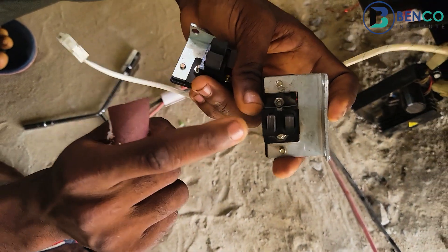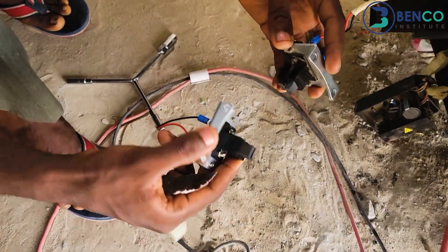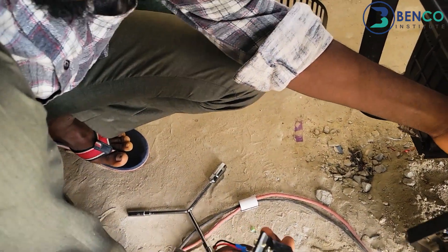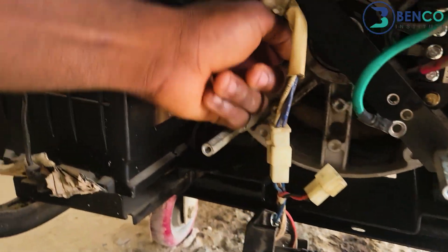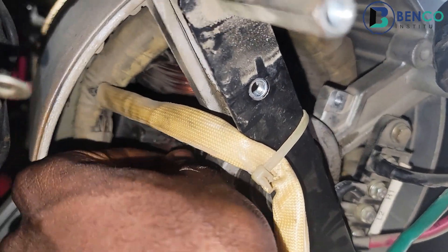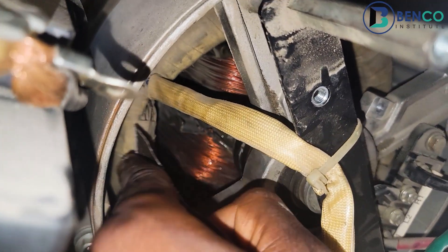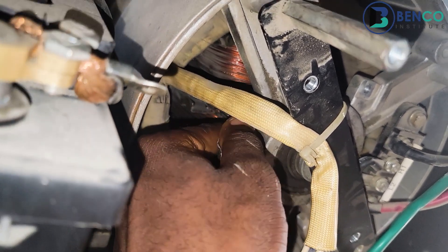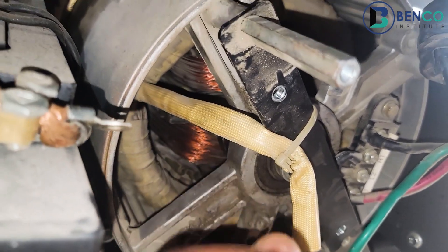What we're trying to do is sandpaper the slip ring a little bit to give this brand new brush a better surface to sit on. This is very technical. What you need to do is kick-start the generator first, then place the sandpaper here on the slip ring — specifically on the last slip ring that appears to have an uneven wear. While the generator is on and rotating, you hold the sandpaper against the slip ring to smooth out the uneven wear.